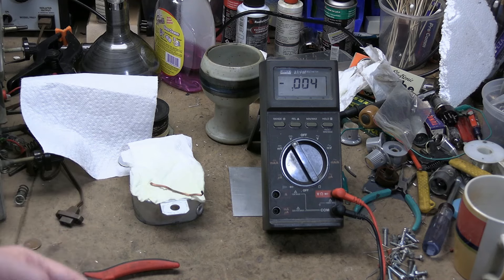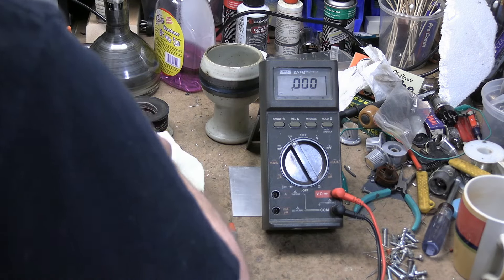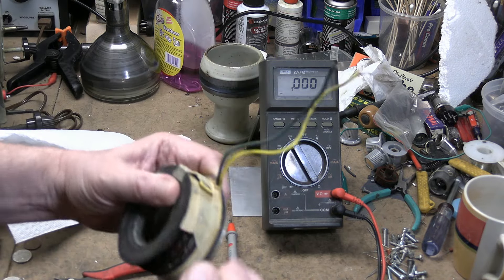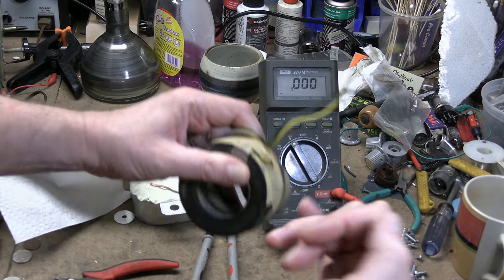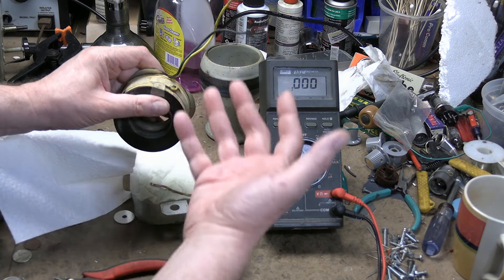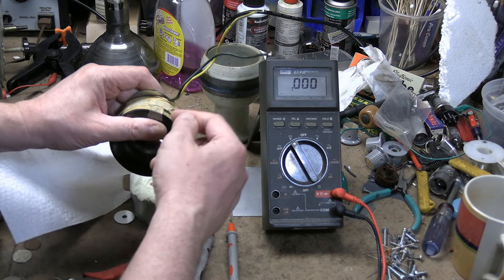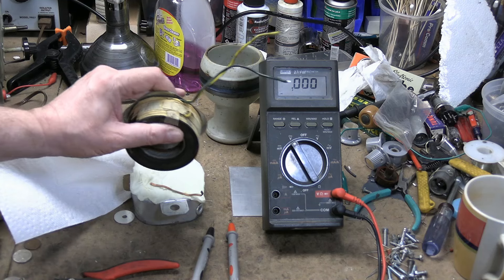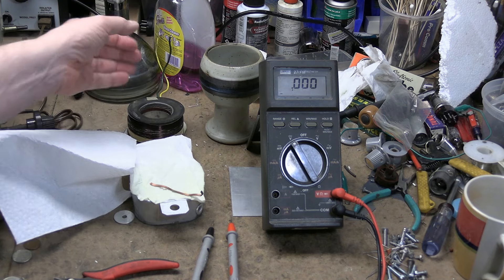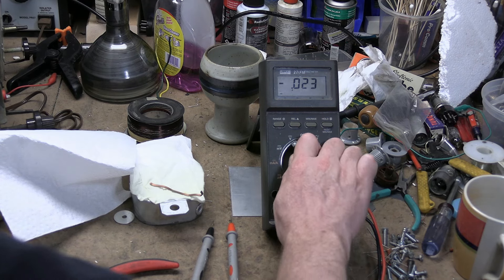There's no doubt in my mind that that is what was causing the problem. The copper in the spool is enamel-coated, so possibly some of the enamel coating has failed. But also there's going to be a junction between these lead wires and the coil — typically a stripped portion of enameled wire wrapped around and then soldered, and there could very well be some exposed copper and the lead-tin of the solder. So it's definitely not completely insulated. We made a battery — unintentionally — and that's what was screwing me up.